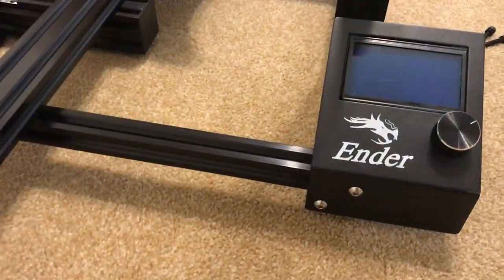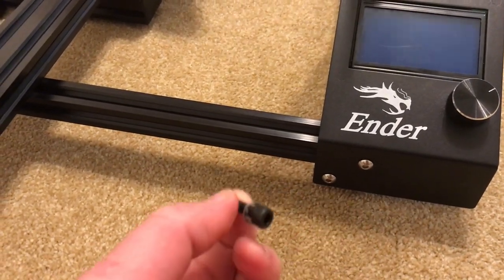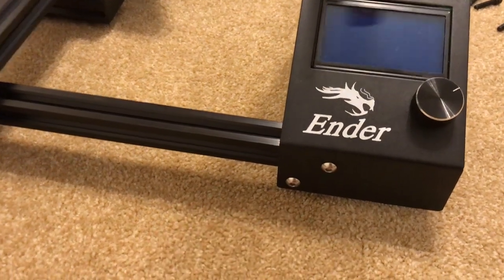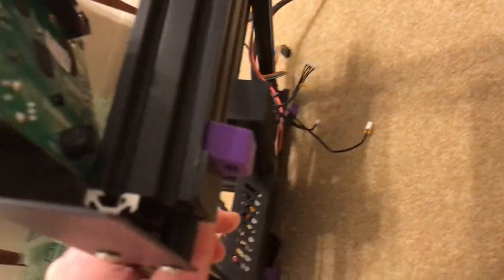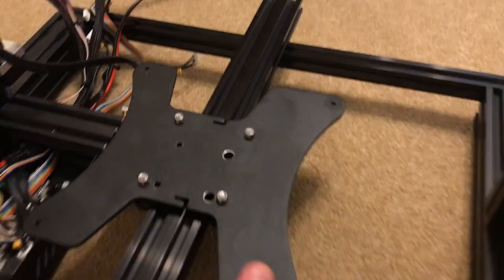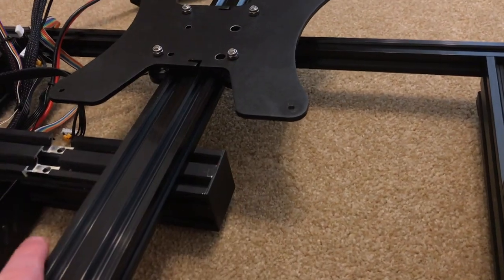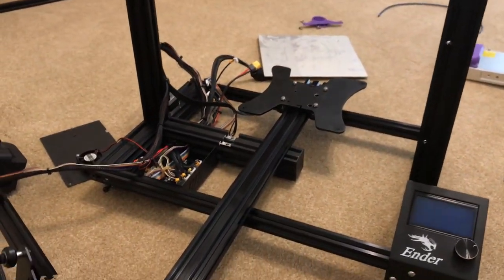Quick update - I ended up getting longer M5 bolts, about 5 millimeters longer than the ones included with the kit. One of the stock bolts is actually still here, just covered by the screen. The two new ones are just a little bit longer. This is nice and solid - you can kind of see the bushing there. Good fit. I've got the lock nuts on top now and no clash. I'll probably add some carbon fiber nylon or polycarbonate brackets here just to stiffen this even more, but I'm really happy with this.